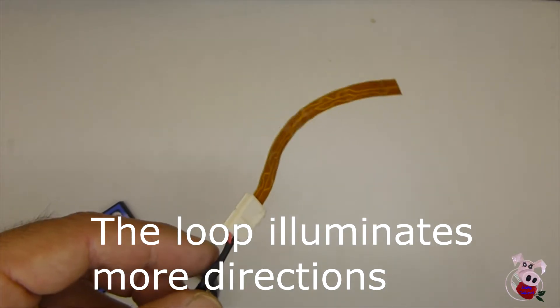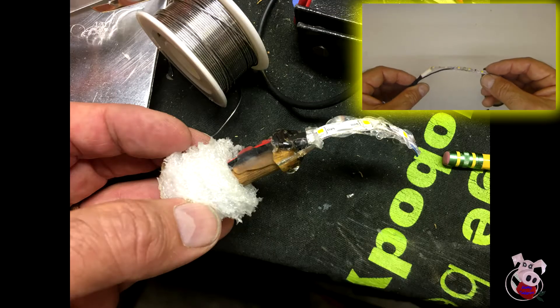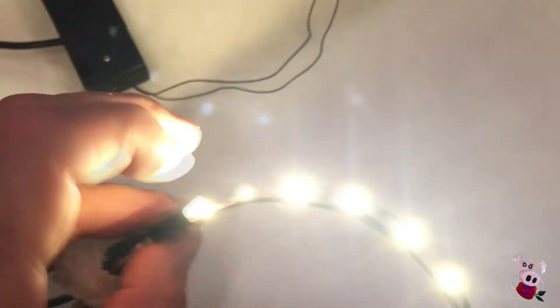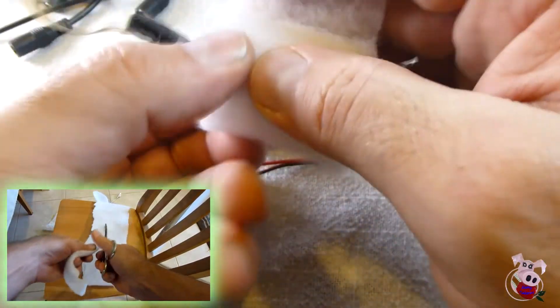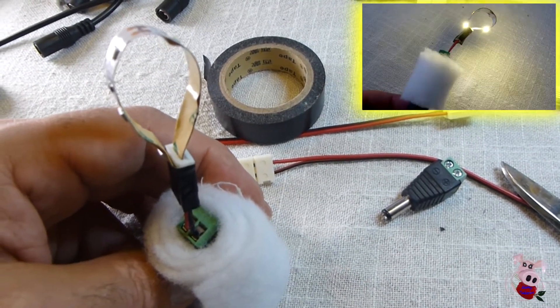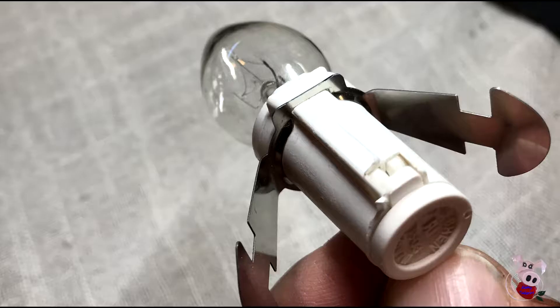As an alternate to doing the loop, you could leave the LED dangling or tape a piece of metal onto the lead and hot-glue the LED onto the metal so you can bend and shape it — just leave a service loop if you bend it too far. To hold the light in the fixture, I used to cut a foam circle, but now I just cut a strip of buffalo snow, wrap it around until it's about the diameter of the hole, and stick it in the fixture. Make sure whatever you use doesn't create enough pressure to break the fixture. LEDs don't get too hot so this shouldn't be a problem.